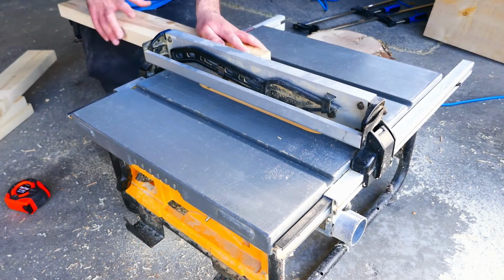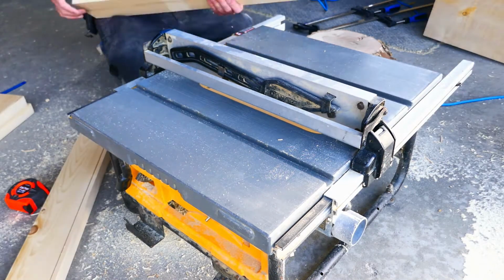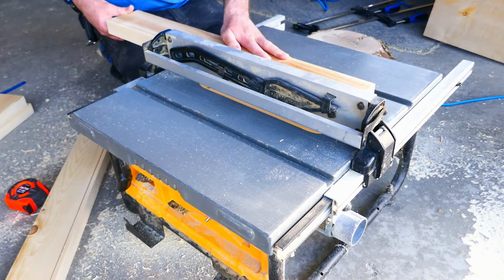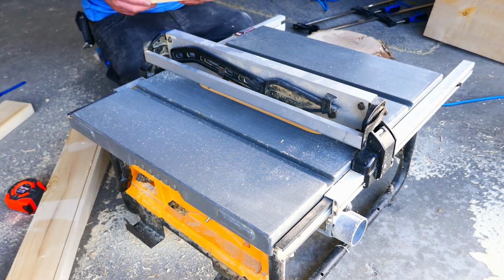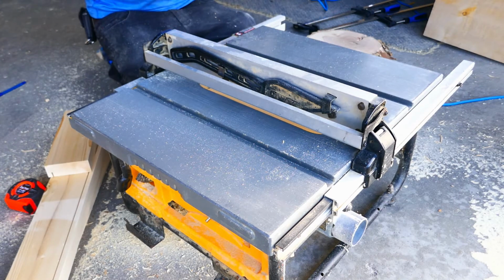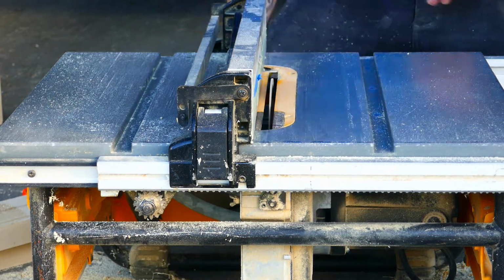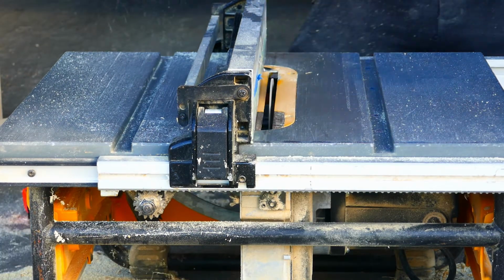After that, I decided the best and cleanest way to put the bottom of the storage compartment in was to cut grooves on the inside of the skirt pieces for the plywood to sit in. I went with 1/4 inch plywood, and a saw blade is 1/8 of an inch wide. I made my first pass, then I came back and set the fence to 1/2 inch and made my second pass. This gave me a perfectly snug groove for the plywood to sit in.